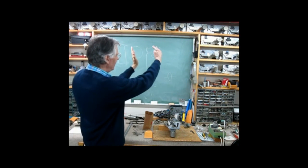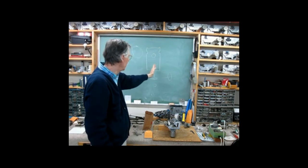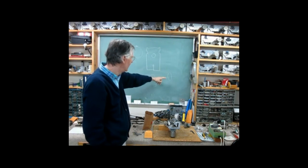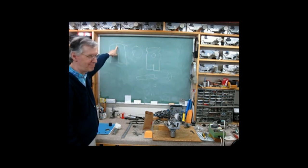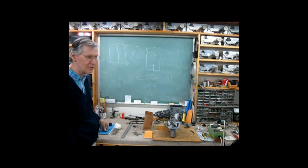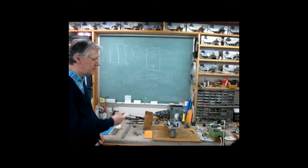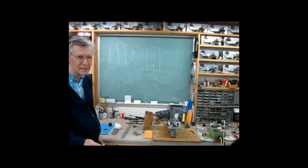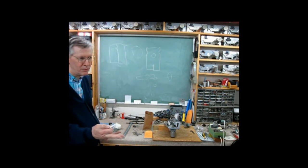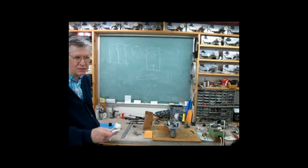And like that. And you're back in alignment here again. And you can achieve optimum radial alignment on this side of the lobe, which is going to move your tip out a few more mils from the drum surface. And so that's how we achieve being able to use a 6 mil contour tip instead of a standard 3 mil. And the result of all this is you double the life that you can get out of your tip.